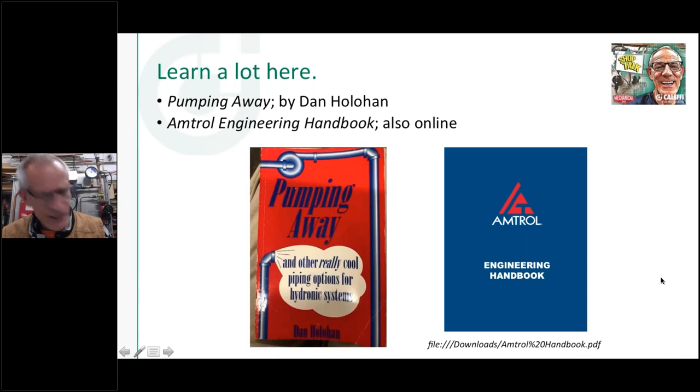But what's interesting about that Amtrol engineering handbook, I got the revision here. I think they've revised it at least four times over the years, and they finally put it on their website as a free download. So there's the web address. If you just go to Amtrol, you can also scroll through there and find it. There's a lot of really good information about all types of different expansion tanks. Amtrol claims to be the original designer of the diaphragm type of expansion tank, so obviously they talk a lot about that. But there are things I didn't know about, like how you size the line going to the expansion tank. There are actually formulas for that. They really don't come into play until you get into much larger sizes than most residential work. But it explains how you size that piping, ways you can reclaim heat from that line, and some really interesting mounting options. So I would suggest that you get both of those and add them to your library if you don't have them.